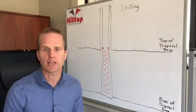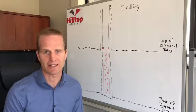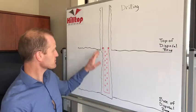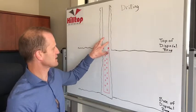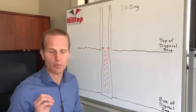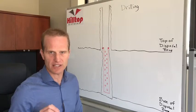In this video, I'm going to be going over the most important part of the drilling, and that is your cementing. So behind me, I've got a disposal well on the board. Why your cement is so important is because after, when you go to complete your well, you're going to have to run a cement bond log and a hydraulic isolation log on the well.